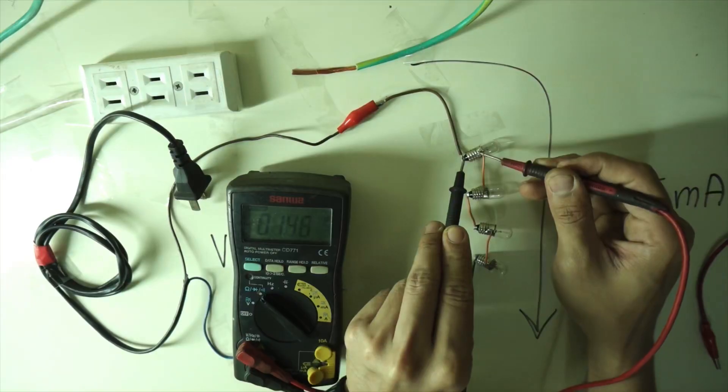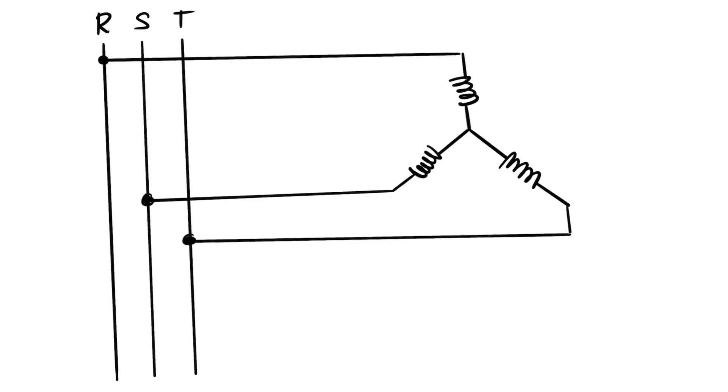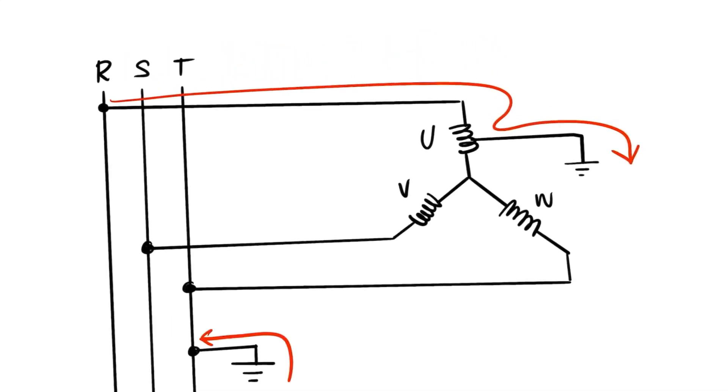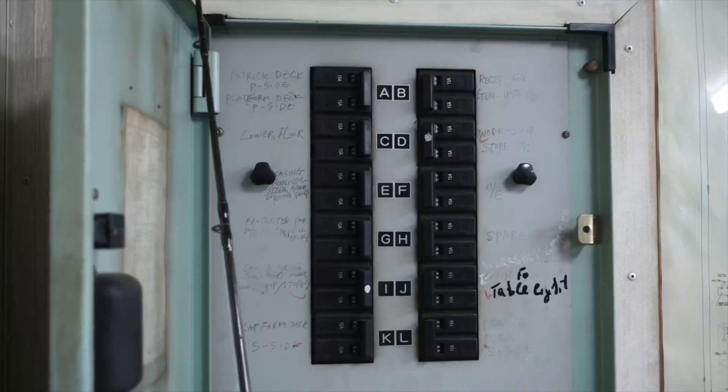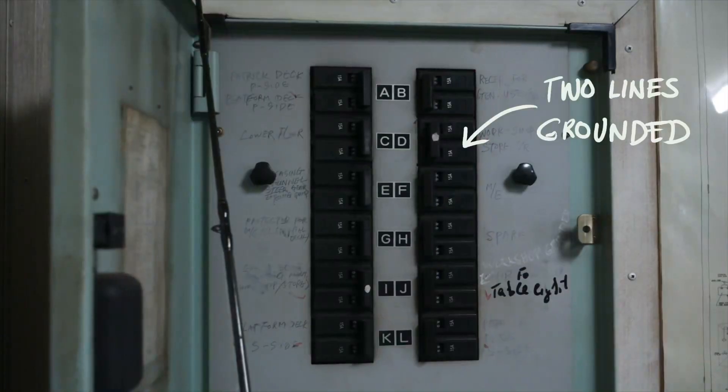I am going to give you another example and explain. What I have here is a 3 phase motor connected to a 3 phase power supply. Let's say my T phase is grounded with 0 ohms reading on the main switchboard low insulation monitor, and my motor's bearing cover fell off and comes in contact in between the windings of the motor and the casing. Current will flow higher with less resistance, and there's a greater chance that your U winding will be burned. So to answer the question, it is important to isolate any low insulation in your electrical system to ensure flawless operation and prevent machineries from being damaged.